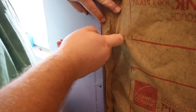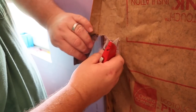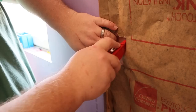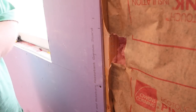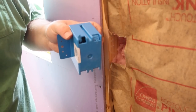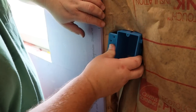I'm making the cut a little bit smaller than my pencil line. I'm going to slice it but not pull it out — I'll let it go behind the outlet. It'll compress a little bit but I'm okay with that, rather than taking it out, especially with how drafty this house is. I'm going to go ahead and pop out my knockout tab with my impact drill — totally the wrong tool for the job but it's what was right beside me. I'm only going to punch one out because there are only two wires coming in.